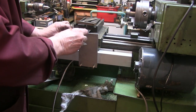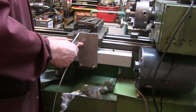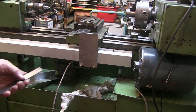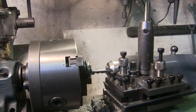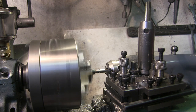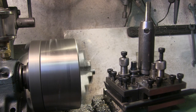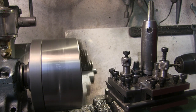Alright, just need to mark this where I'm going to cut it off. I need to make the little spacers between here - I'll make them about 27mm. Now I'll cut that off, get the spacers on there and then drill them out.